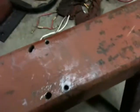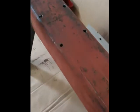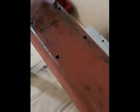The surface makes it difficult to see, but they are reasonably accurate holes. I even deburred the edge with a little bit of a countersink to clean them up. After conveniently forgetting that 8mm — approximately 5/16 inch — was bigger than the 6mm or 1/4 inch holes I drilled previously, I had to go back and drill out the holes a little bit larger.